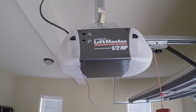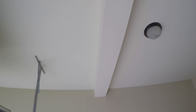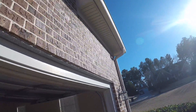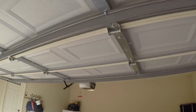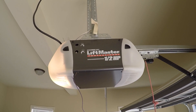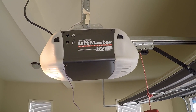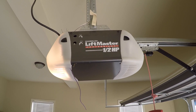I'm going to show you today that I'm going to replace not only the bulbs here — I have one, two here — I also have two on the ceiling and two outside. The reason why I'm replacing all six of these bulbs is because one of my viewers had an issue when he hung LED Christmas lights this year and the Christmas lights interfered with his garage door opener. So always keep in mind when replacing bulbs in or near your garage that they need to be either old-style bulbs or LED bulbs that do not emit the same frequency as your opener.